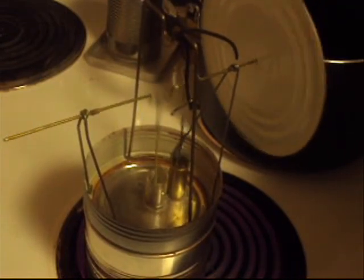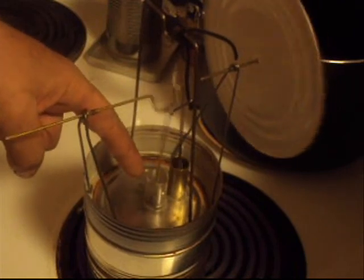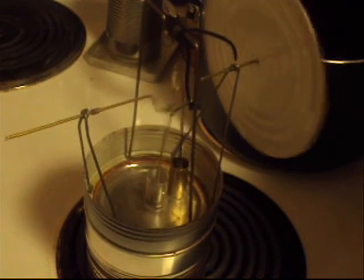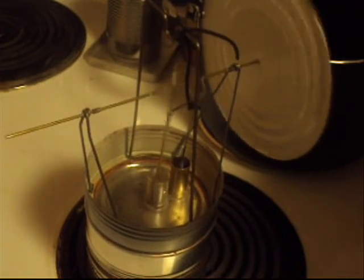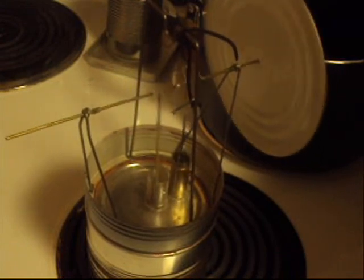Not very good. Same thing if you get water down inside. I had to put some super glue around the base of the water block for the displacer rod and also around the bottom of the piston again, just to make sure it didn't get any water inside. I had a little bit of water get in there — I took the piston out and spun the displacer around, and big old puffs of steam came out until it dried out. That was a lot of fun.